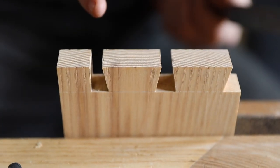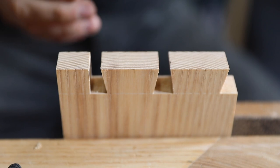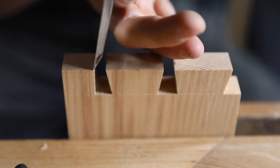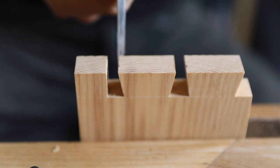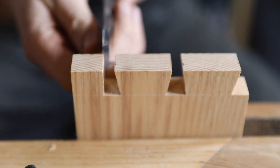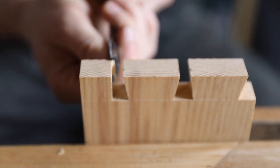So as I said, I've left it slightly shy of the line that I scratched along the top here with the marking gauge. You could try and saw to that, but when I've got a marking gauge line, I like to try and chisel to it straight away. So what you don't want to do at this point is put it straight into that line at the top and whack it down, because it's just going to split the grain and you don't know which way it's going to go. So what we're going to do instead is find the vertical line either side, there and there by the looks of it, and just pare it across